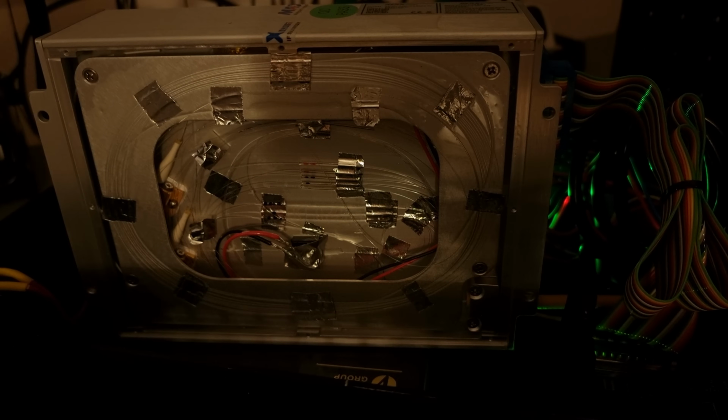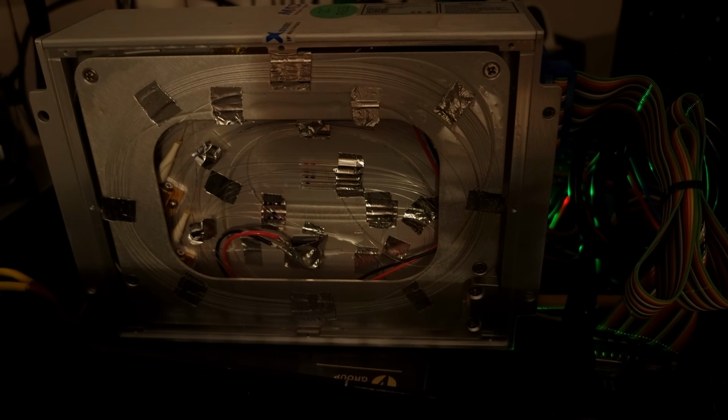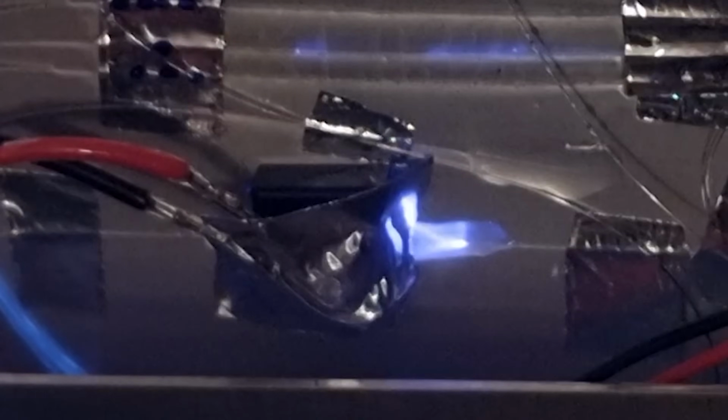All I can say is that the forward-facing elevated section of fiber is the doped gain medium, because it has been arranged with a modicum of care and siliconed to that plate for a bit of heat sinking. I think this is a power sensor, because its black cable goes to ground and its red cable goes to the inverting input of an op-amp.